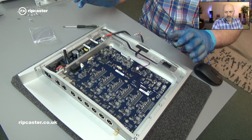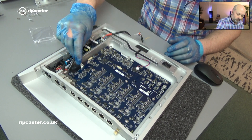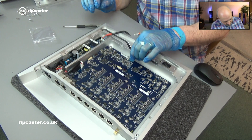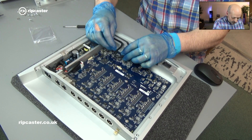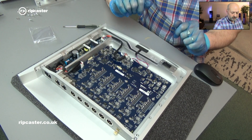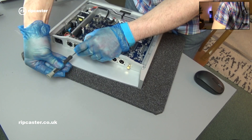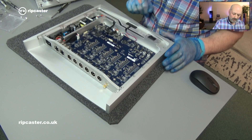So that's the board secured. All we need to do is now reconnect the cables. We'll put the mains in there and just dress that. The LED off the front — we'll just dress that. And then the actual mains cable as it comes off the power supply. Internals are done. We'll now put the retaining screws in the XLRs and the RJ45s. So we've finished securing the back panel connectors and all the cables are good.